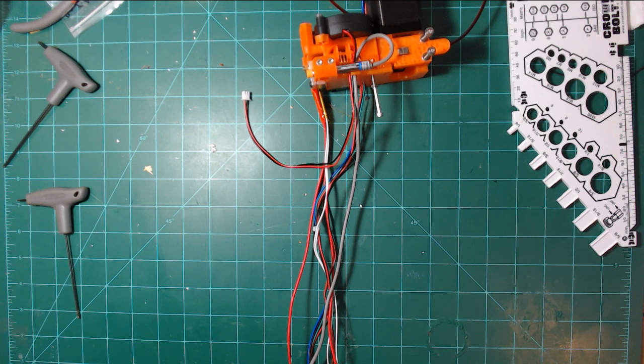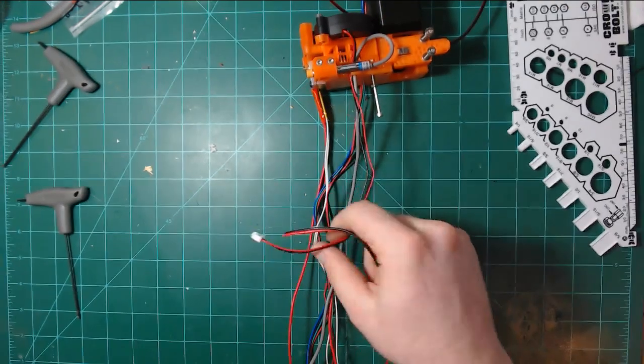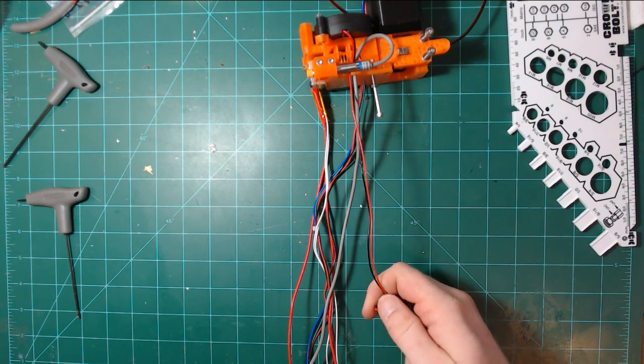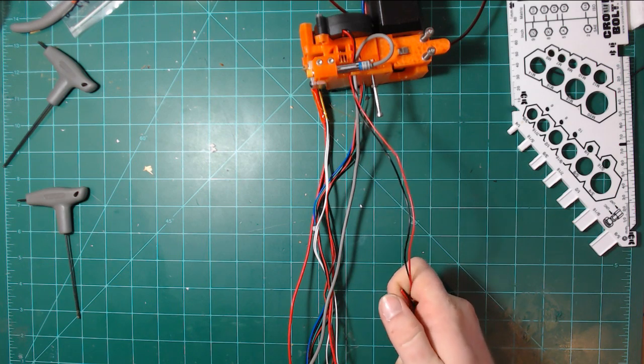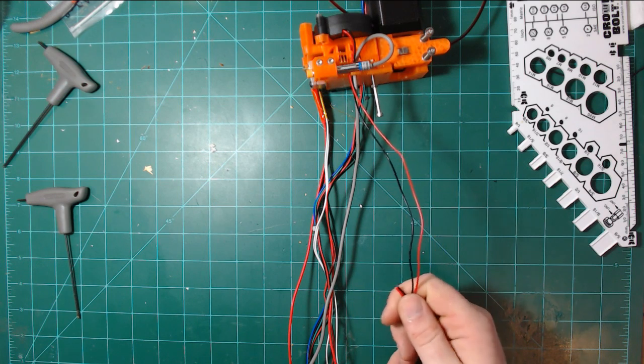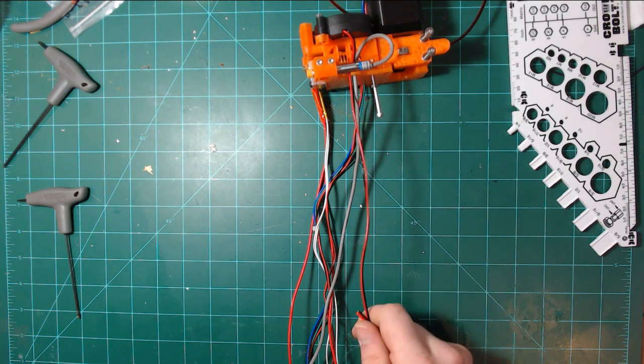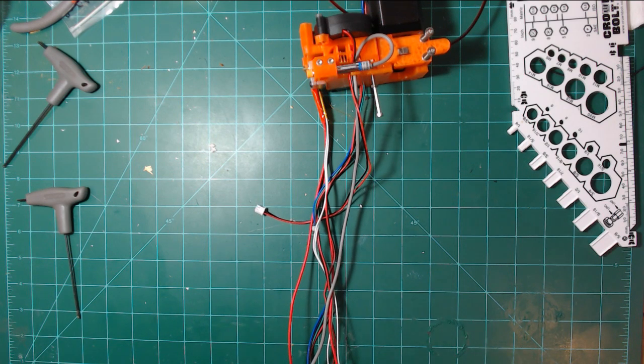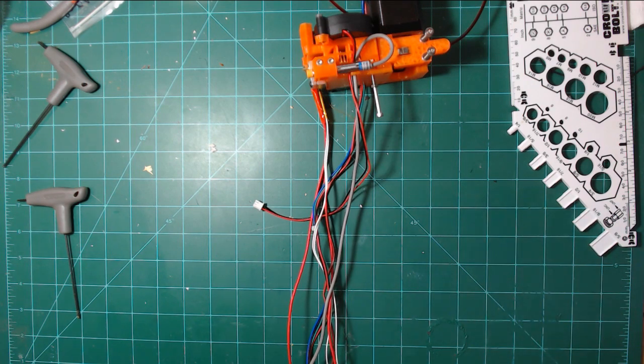Rob, Einsy board, yeah, that's the Einsy. Isn't Einsy what they use in the Mark III? There's the Rambo, which is the Mark II board, and then the Einsy Rambo is a special version for the Mark III. It has 2130 stepper drivers already built into the board. I think it has a port where you can plug in the Raspberry Pi Zero and load OctoPi directly onto that. It's definitely a nice board. They're very expensive though.